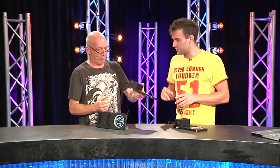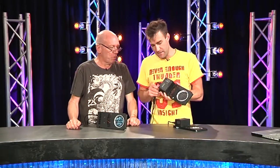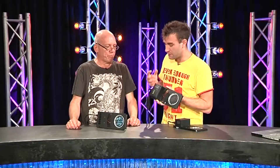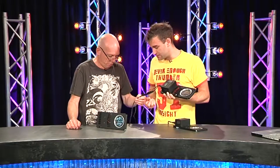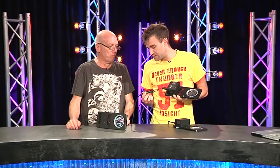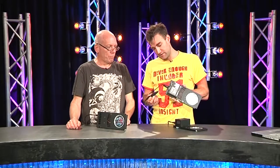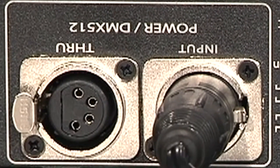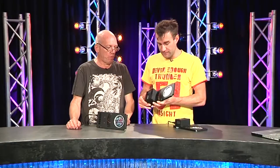This is where it gets interesting. This one doesn't actually have a 240V input — it's just got a four-pin connector. On that four-pin is carried power, 24 volts from a separate power supply, and DMX. The nice thing is that once you've fed one of those devices you can just link up a couple using standard four-pin cables off the same power supply.